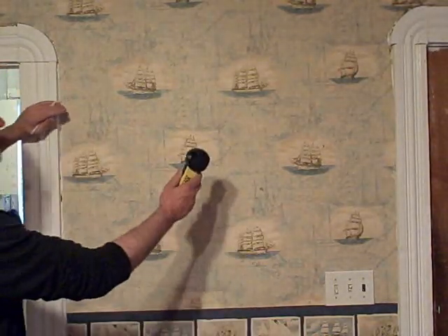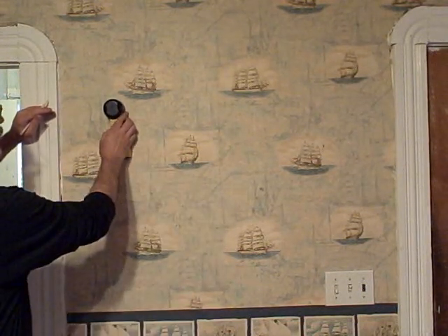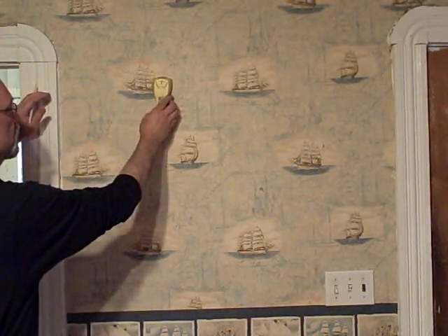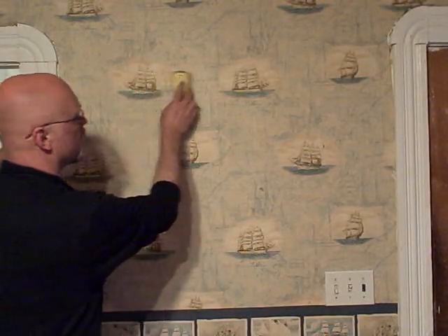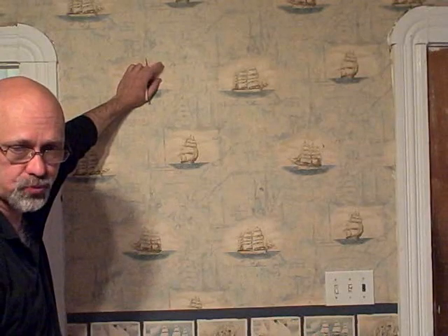The Secure-T is something that museums often use because it mounts objects — usually pictures or paintings — to the wall in a secure way that keeps them locked tight and very strong. The first thing you need to do when mounting something like this is to find the studs in your wall. I have a stud finder here — you use it to find the studs within the wall. I found a stud here and another stud here, so I'll be able to anchor my mounts right into the studs, which is very important. I don't want to just put it in the sheetrock because it's not as strong.